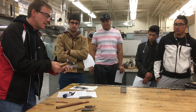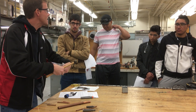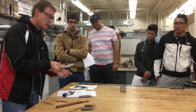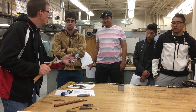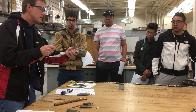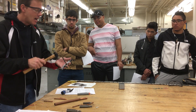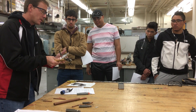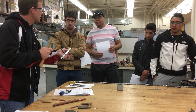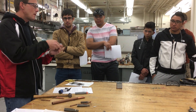I'm only going to do three taps, and then I'm going to rotate it around, doing three or four taps each time. Why do I rotate it around? What happens if I just do one side over and over? It would be uneven. After you get it in, you don't even need to hold it anymore — just stabilize it. Keep rotating it around, and then eventually you'll hear the tone change in that tool. It was a lighter tone, and then it goes deep — that means it's done. It's bottomed out. We bottomed out the swage.